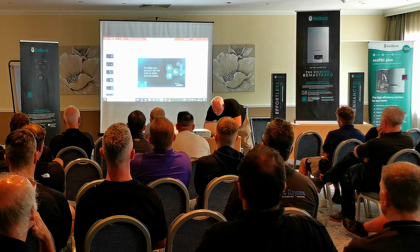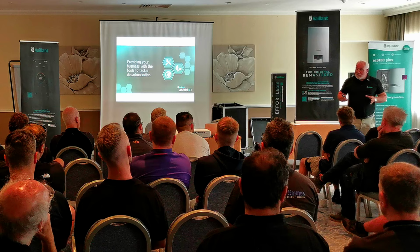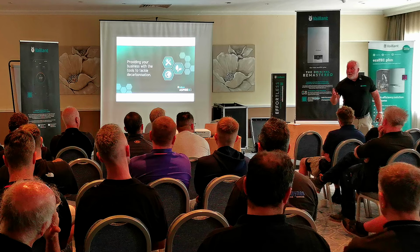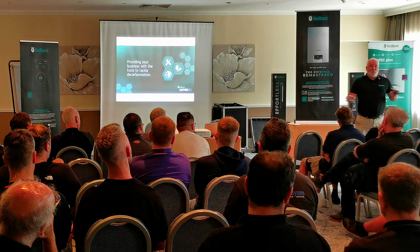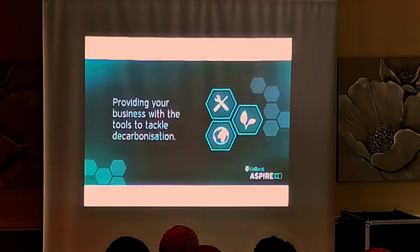But obviously, the other thing that I didn't mention, you'd have noticed probably the green one, the AC isolator with the heat pump was higher than the unit. With R290, that's the only issue, because it's propane. It's a bit like LPG, really. There's a safe zone for propane. If it was to leak, in the unlikely event, it settles. So you have to fit the AC isolator, the rotary isolator, above the unit. You will see heat pumps with the AC isolator at the side or even covered, but with R290 one thing we have to do, and that's everyone, is fit the AC isolator above, just for this safe area.